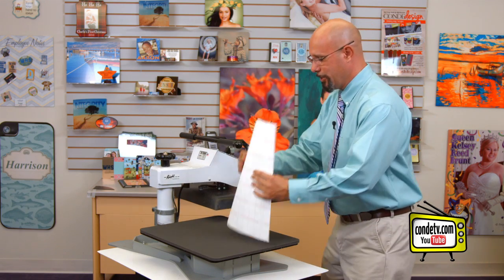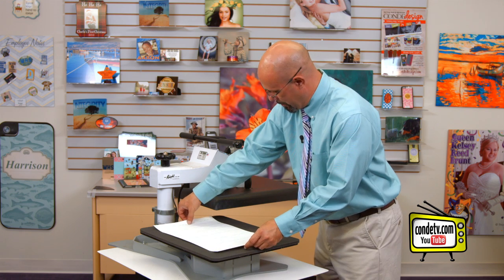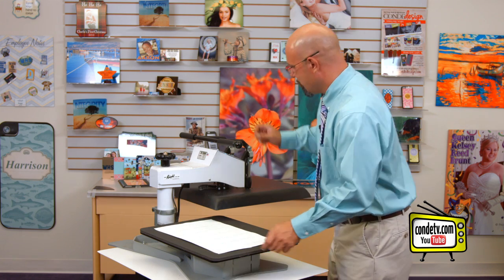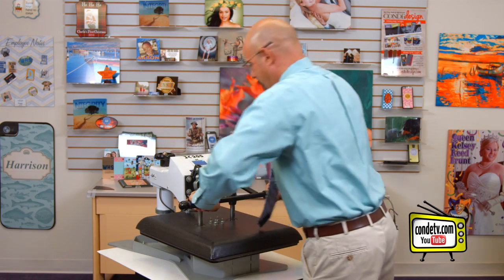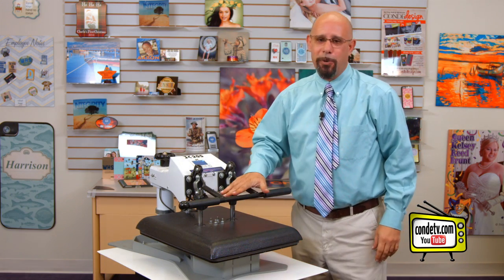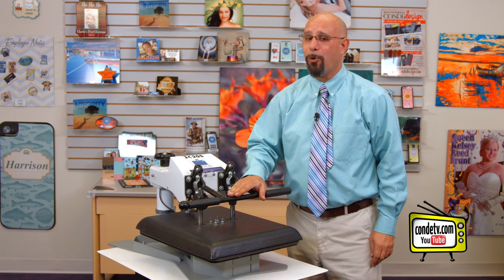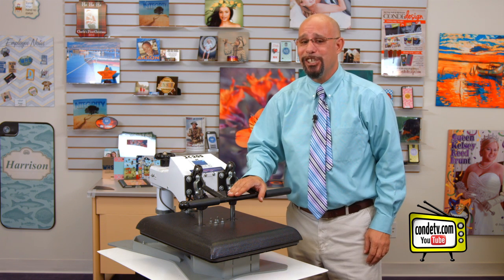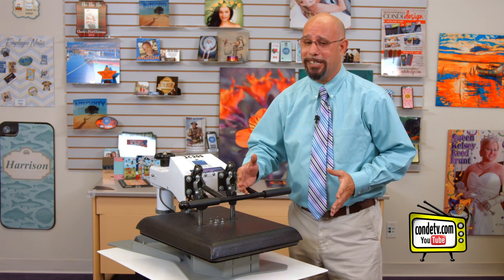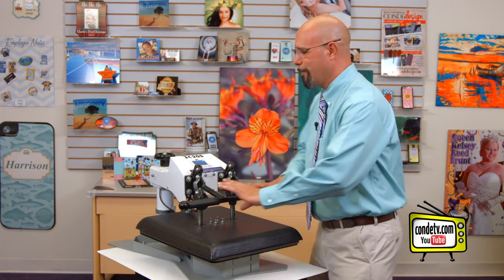Let's open up our press, align our two sheets, place them in the same position, bring the press over, lock it in. Now this is what I would consider to be very heavy pressure. If we did this with the old formulation Neenah ImageClip laser light, we would probably have a solid sheet of emulsion over our printed design. We'd probably also have toner that migrates from the imaging sheet to the transfer sheet, a clear indication of too much pressure.